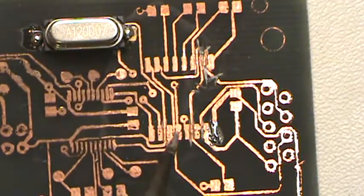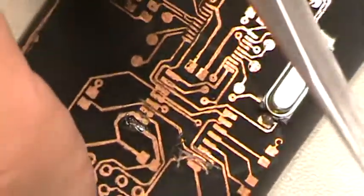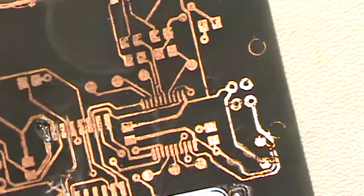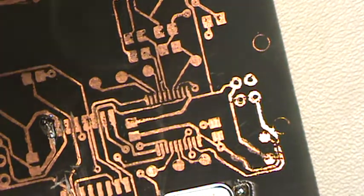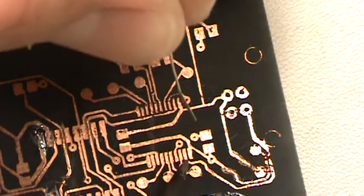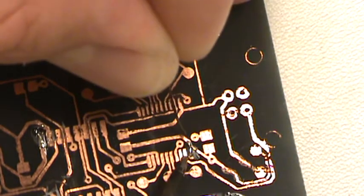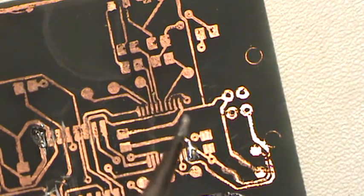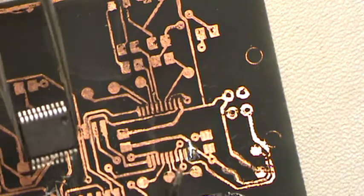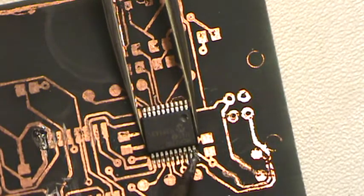It's another thing about when you scribe your own boards: make sure you keep a drawing of it next to you, because, boy, it's difficult to get stuff turned around and get parts backwards. You don't want to do that, otherwise you'll be putting voltage where ground should be, and it becomes just a nightmare. After a while, you'll start blowing components up and not knowing why. And then you realize, oh, I put that on backwards. It's not good.